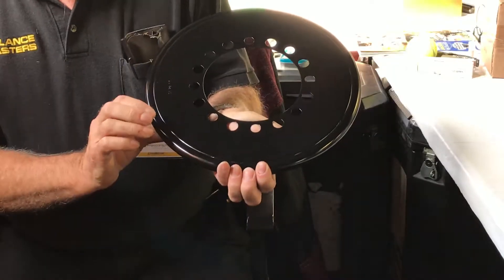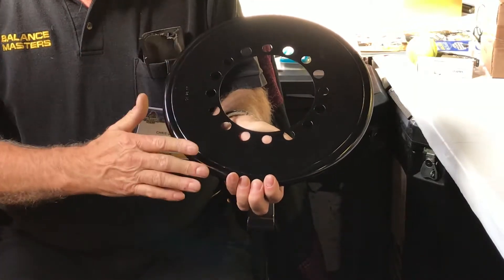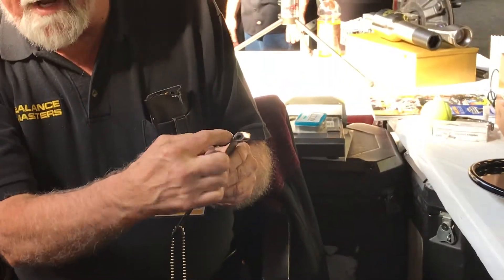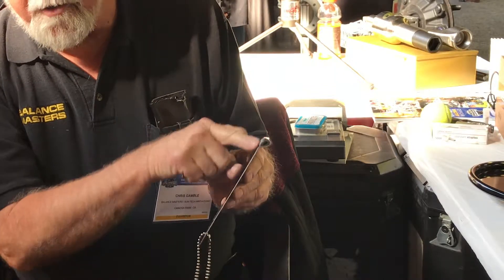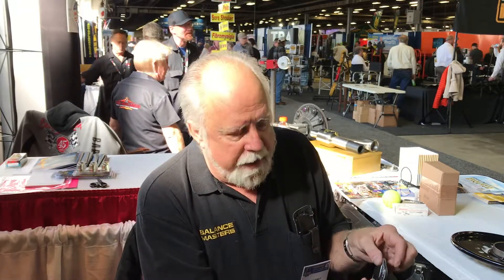What's inside there? There's actually a small self-sealing rubber bladder with a measured amount of mercury. Mercury is approximately one-third heavier than lead, so it doesn't take very much — and because it's a liquid, it'll flow to wherever it needs to go to keep that part of the assembly in balance. This is one piece of metal wrapped all the way around; once we set the tube we close this completely over, and because it's an inward cut, there's no way it'll reopen. The self-sealing bladder is important: if you had an accident, a cut or puncture, it automatically pinches off that area around the tubing and seals it so you don't lose any of the mercury.